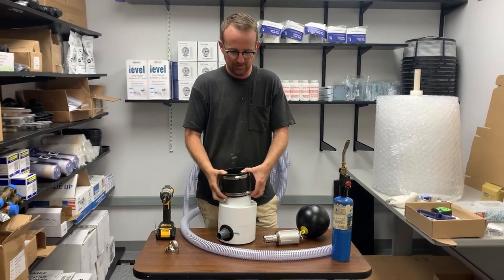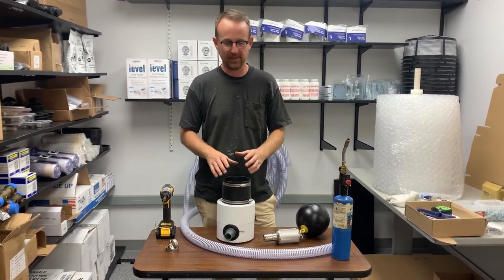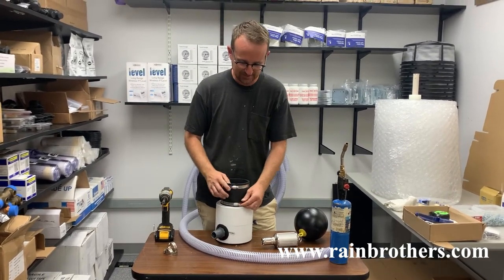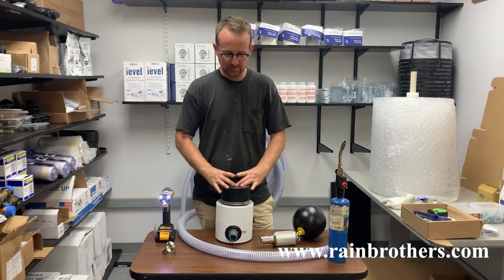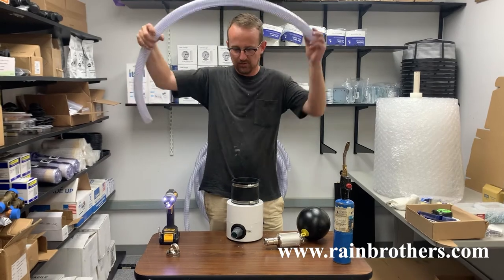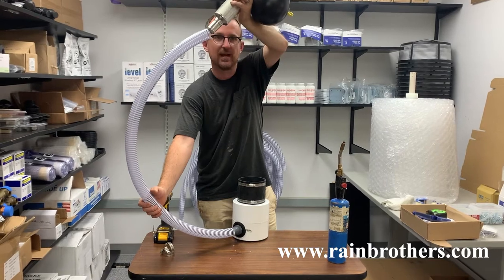You'll add the FernCo fitting to the top, and then your submersible pump — which needs to be either a three-inch or four-inch, or if you buy a pump from us any of our pumps will work — you're going to take the base off the pump and the intake screen and slide it into this assembly, then tighten the two hose clamps with a 5/16 hex head driver. The intake should be inside this six-inch pocket, and the water will flow into the intake sleeve through this flexible TigerFlex piping and ultimately hang from this floating assembly up at the top of your cistern.